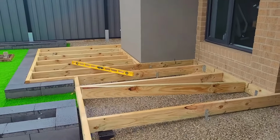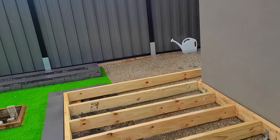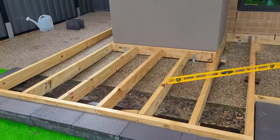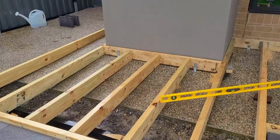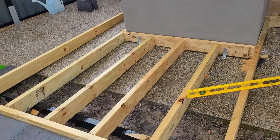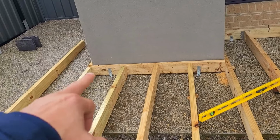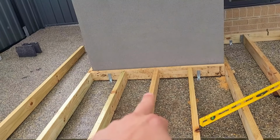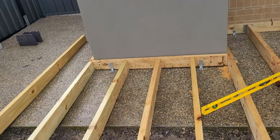So my takeaway from this, or maybe my method of building it, I would recommend, if you can do the paperwork first, if you're not experienced, like which blocks, it's just like a puzzle, because if you know how you can divide this deck in a modular base, that would be ideal. For example, this particular joist, I just attached this 1, 2, 3 and 4 together by screwing it from behind, and then I install these 4 together.